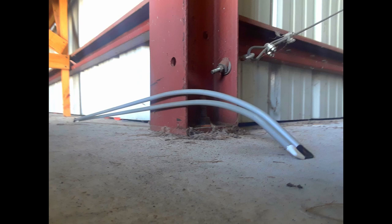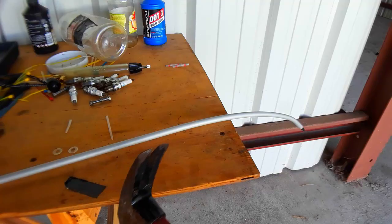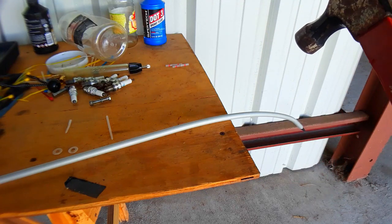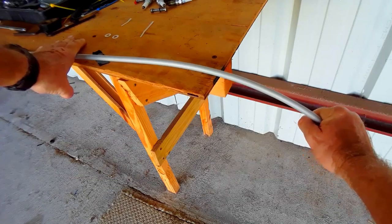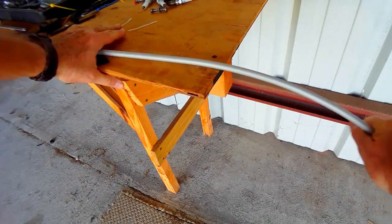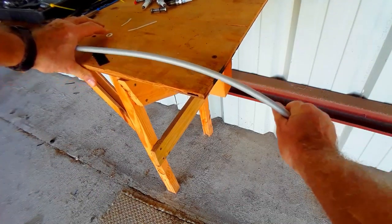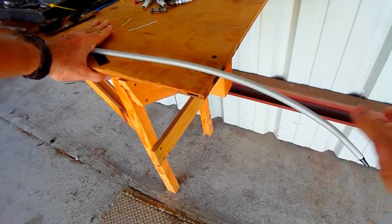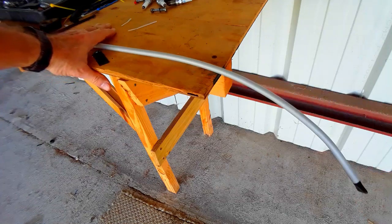Here are better photos of the incremental change made to the black tip batten — it's taller, it has more camber, it will have more lift. So how do we bend those battens? Get a hammer — a ball peen hammer is better. Wait, don't. Stop. Not that. This way is also risky — one kink and it's garbage. Best to bend the batten around a radius: a tree, a drum, or drop in on Terry Short, owner of Hawk Aircraft and master builder extraordinaire.